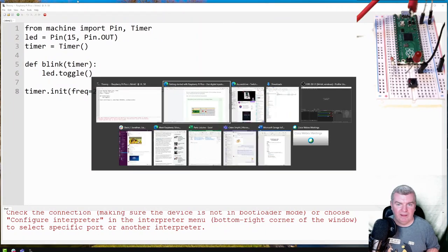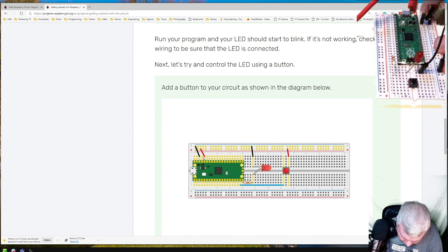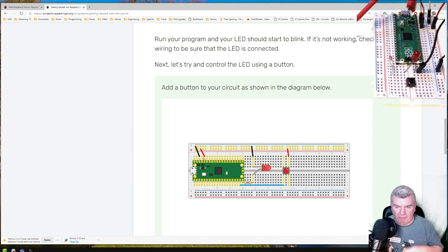Let's look at what it actually says. They're going to use that rail and connect to 3.3V — so we're pulling the button up high to begin with. That must be three volts going there. The other side is going to go to the pin next to it. Live electronics assembly! Be careful because there are two different rails — they're actually inverted. So we're going to be pulling the button up high to begin with and I've not got a resistor on the other side, so that's fine.